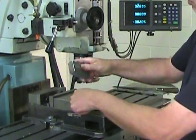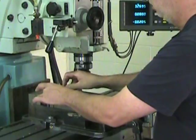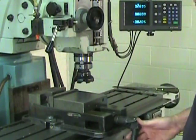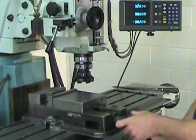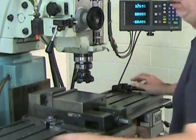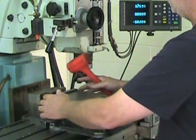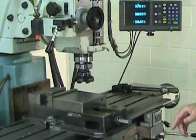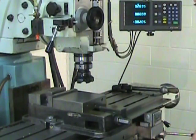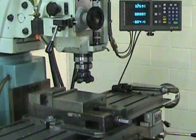So, reference towards the bottom, reference towards the fixed jaw, I can install my part and tighten everything down, still using that brass cylinder. Don't forget to seat the part with your dead blow hammer, and this time, since our secondary reference surface is flat, we're going to get good contact. And since we know that we're already about at the right height, I won't have to skim the part. All I have to do here is just raise the table by about 1/10 of an inch.